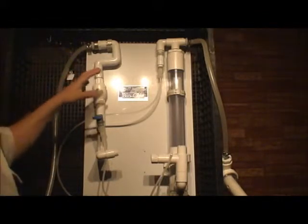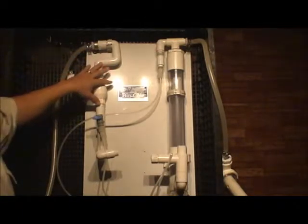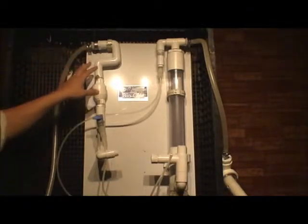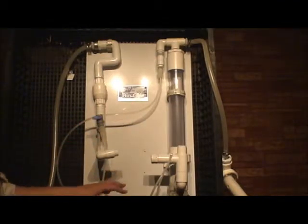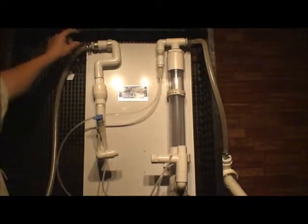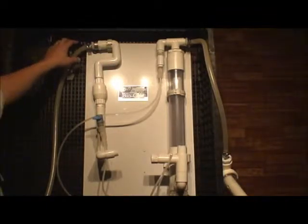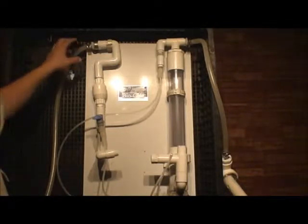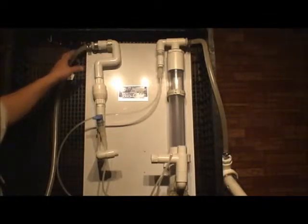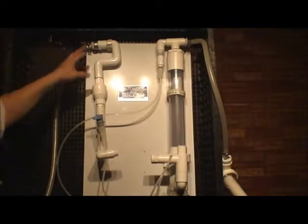When you allow the pressure on the inlet side to reduce to below 20 psi, once again you see an efficiency drop on your Olas Ti pump system. So it's always a good idea to have a pressure gauge here on the inlet supply to the Olas Ti, and a water flow rate gauge also. If you anticipate flow rates below 24 ounces a minute, then you ought to have a flow meter there. If you're anticipating pressures below 20 psi, you ought to have a pressure measuring device, like a gauge.